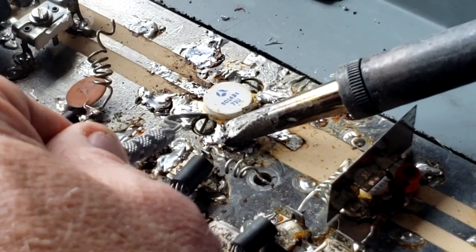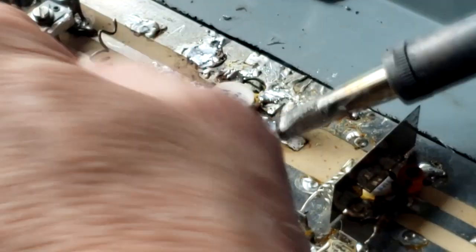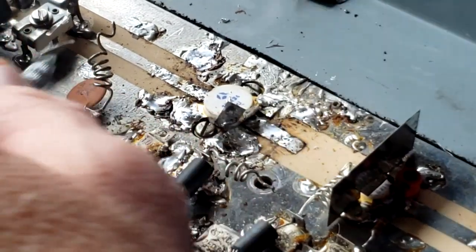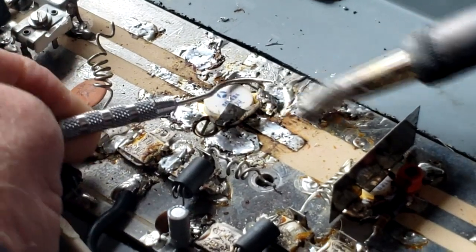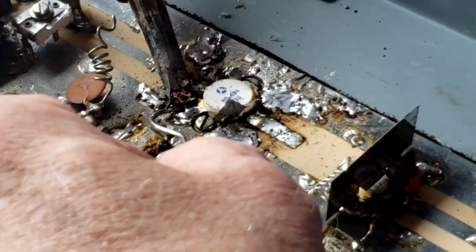causing this to loosen up, now one of the emitter leads, and we'll start pulling it high. And since we're not going to reuse it, we don't care if we bend it way out. Likewise on this side. On the other side as well. Let's get it going. We'll scrape underneath and pull it up and out of the way. Do that on all sides.